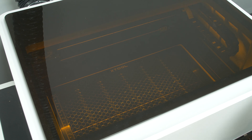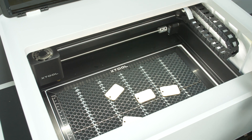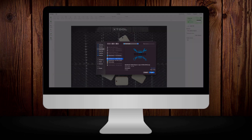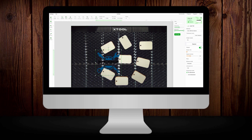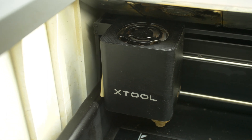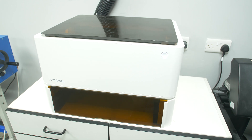One of the first most fascinating features, which is very different to a CNC I've worked on in the past, is it's got a 16 megapixel camera in it which takes an image of whatever you lay in there. So you don't have to square everything up or do everything by eye — it loads into the computer and you overlay your designs without worrying about exact position. The head also automatically focuses itself, whereas on traditional older machines you have to manually focus the lens. This takes all of that faff out for you, making it much simpler to use.